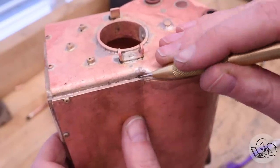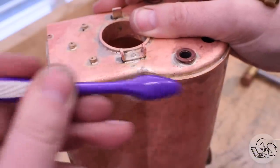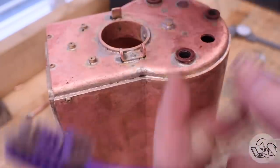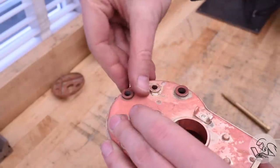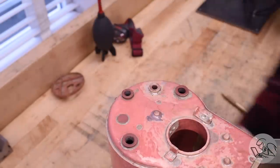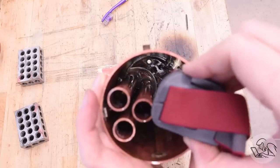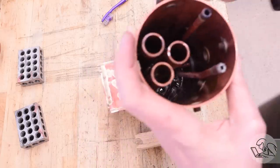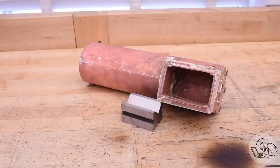I was also inspecting the throat sheet again after each one of these joints, and I don't think I redamaged that joint — although I can just feel it's going to be trouble. If it fails a pressure test, it's going to be that joint. Final step here then is to solder in the blower pipe, which I did while you weren't looking. That went okay — it's an ugly looking joint, but I think it's mechanically sound. I took the torch away a little too fast and some of the solder didn't quite flow, but I can see solder that came through the bushing all the way everywhere, so I think the joint is sound. It just looks a little ugly — I'll file that down a little bit after the pressure test if everything's okay.